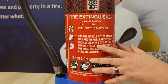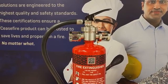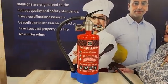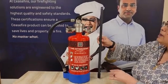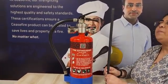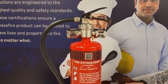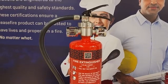Apart from that, it also contains dry nitrogen as a propellant at 15 bar. The agent needs to be thrown out of the cylinder when activated and therefore you need a dip tube. This is what a dip tube would look like. It is attached precisely to the valve such that at least 90% of the agent is thrown out when the system is activated. These are the internal components of this particular product.